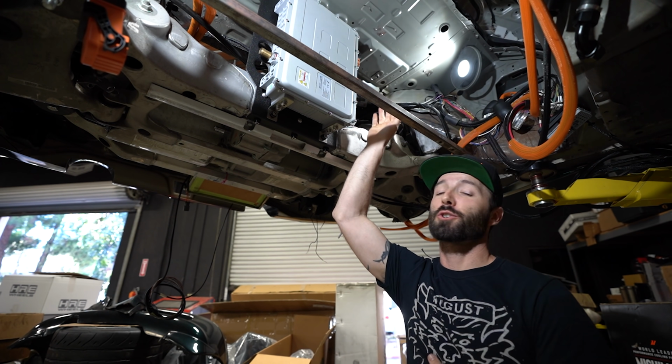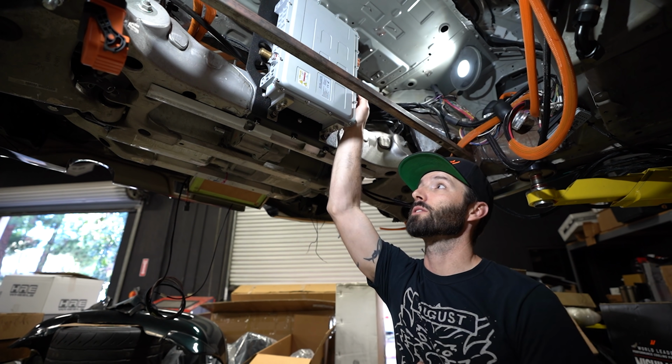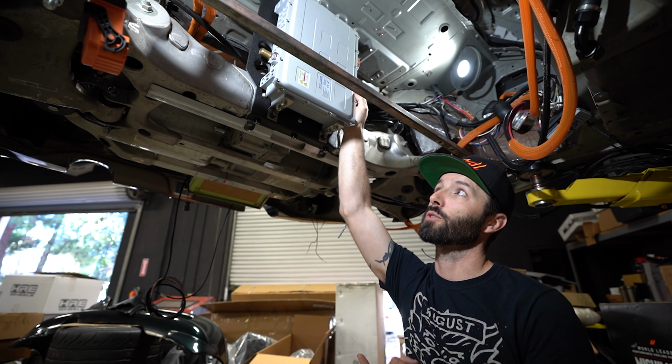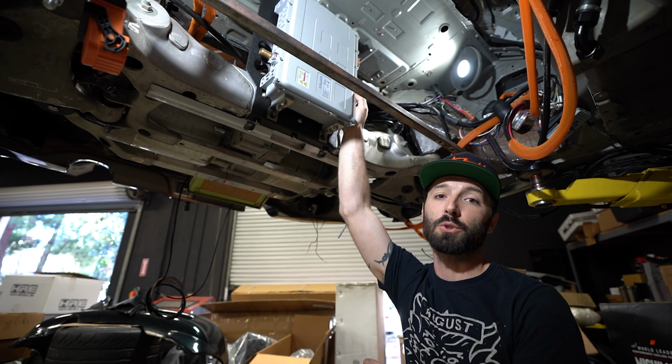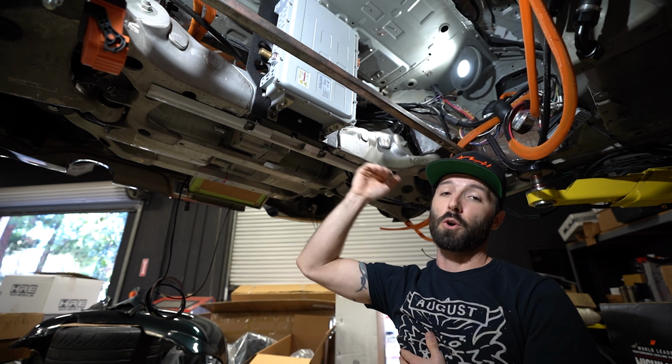All right, so our charger DC-DC is in place. Now, to go further into detail about what this thing does, it's going to take the wall power. It can be 120 volts or 230 volts AC. That's level 1 and level 2 charging. So that's going to charge our pack at 20 amps, which is the top current that it's going to send to our pack.